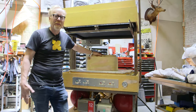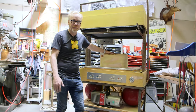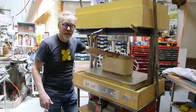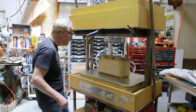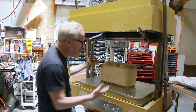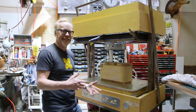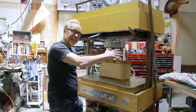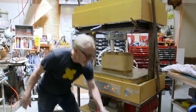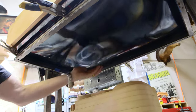In practice it's a bit of a touchy art form. I don't expect the first pull to go perfectly, but I'll learn enough to make the second and third pulls go really nice. The first six heating elements are a go. The ABS is slowly heating above my MDF buck and I want it to droop a fair bit. Now, if I turn on all my heaters at once I'll blow my fuse, so I can turn them on for about a minute to get the ABS sheet warm before that happens — and I need that fuse to pull the vacuum. Hopefully when this thing droops down to about here it will be flexible enough that when I pull it down over the buck and push the frame down around it, I should get a really nice pull. It's doing good, it's getting nice and soft.